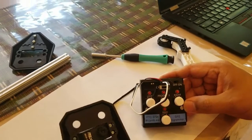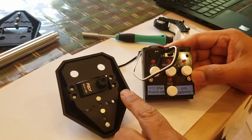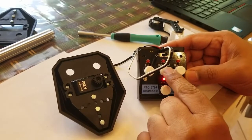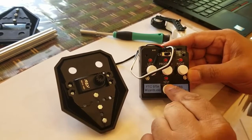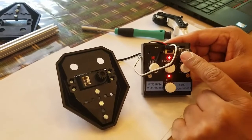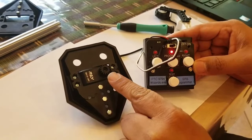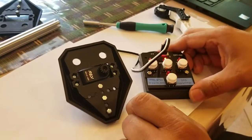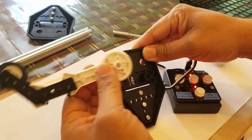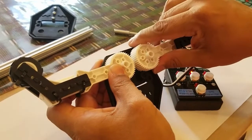What you see is the gear starts moving, going from one position to the other. In this mode, it goes from an open position to a closed position. To program it, I'm going to hit the program button, then test one more time — not the program button. Now you see the program light and test light are both on. The servo gear is now in the center position. With the servo gear in the center position, I'm now going to attach my two arms.